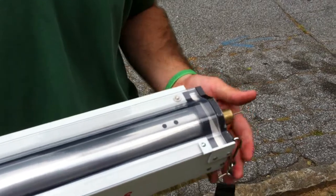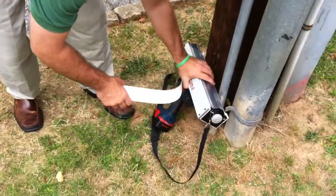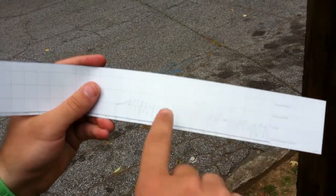Compromised wood — wood that has been damaged — will not provide much resistance and thus has no strength. And as you can see on the printout results that we get from this, you see that we've penetrated 6 inches into the wood and you can read based on the rings of the wood the strength determination.